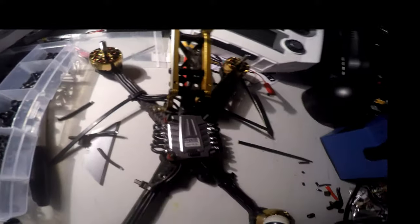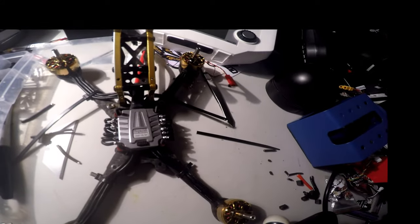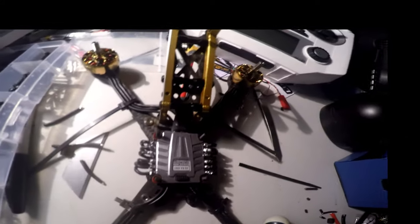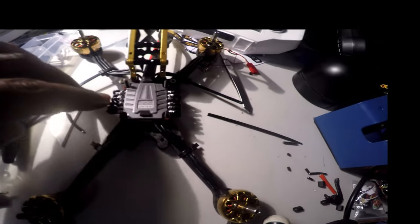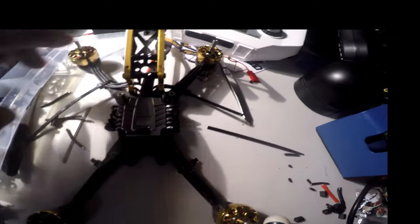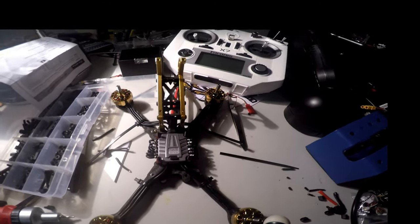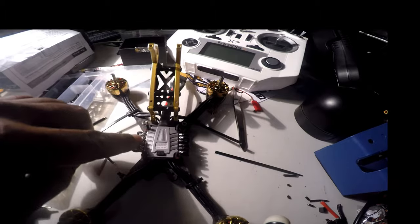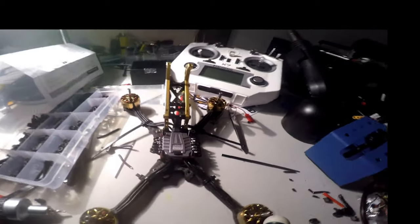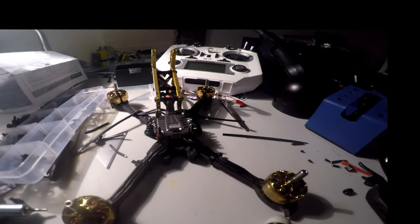She's looking nice. And like I say, once I get a new camera with autofocus, we will be doing it step by step. But now you can see you got motor wire 1, 2, 3, and that's how you follow it on the ESC, 1, 2, 3, 1, 2, 3 all the way around. If the motors spin in the wrong direction, you can change that inside of BLHeli, or you can cross these two wires right here, put this one on this side and that one on that side to change directions. But I find it easy to do it in BLHeli. Sweet.